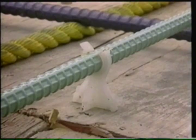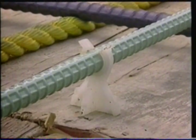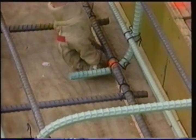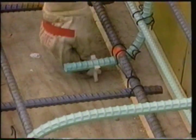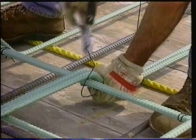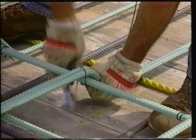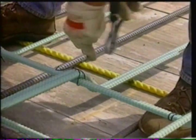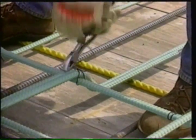Use non-corrosive, non-conductive bar supports, such as plastic bar supports or metal bar supports coated with epoxy, nylon, or PVC, to eliminate a potential source of corrosion and to avoid damage to the coated rebar. Tie wire, which is typically black annealed wire, should be coated to minimize damage or cutting into the bar's coating and to avoid creating a direct electrical contact between intersecting bars.